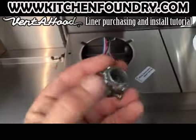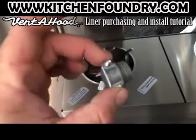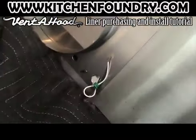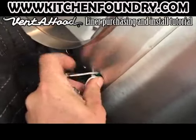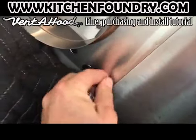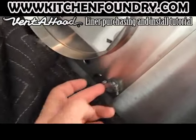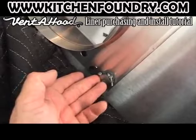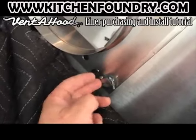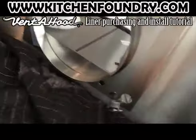Here's a look at the strain relief I use. It's about the size of a quarter. You're going to back this tensioning nut off. This is how we screw down the Romex wires feeding the top of the hood. Now this electrical needs to be tucked into this hole. You definitely don't want to make your electrical connections above this hole, because then if there's a service concern later, the whole hood has to be removed in order to get to the electrical. We want the electrical connections within this box behind the motor and the Romex secured down.